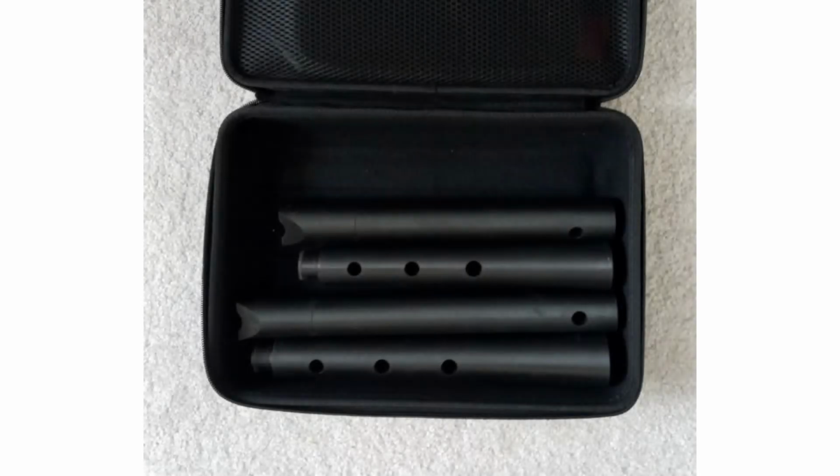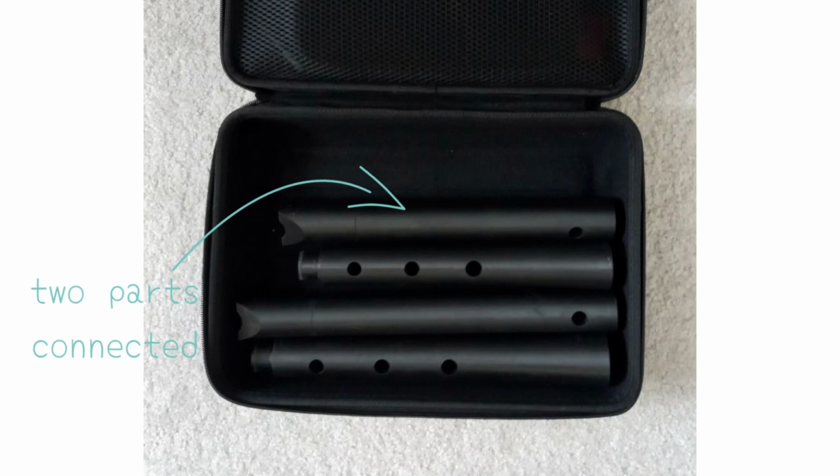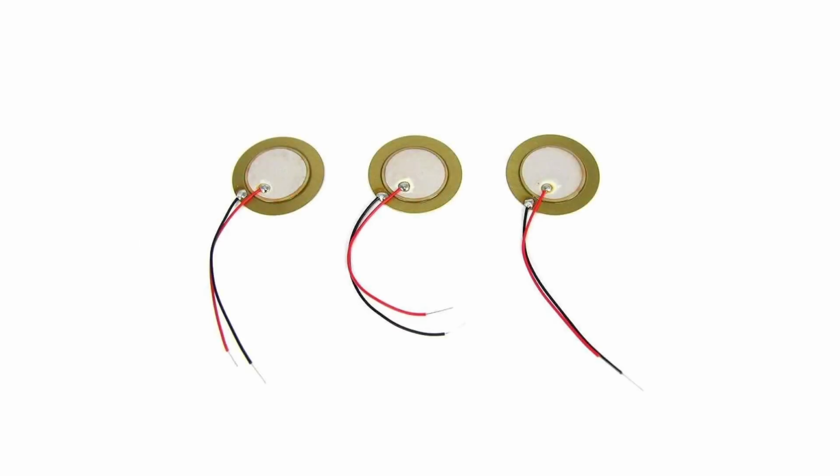As a lucky coincidence, the shakuhachi flute I designed earlier was made in 3 parts and not, as it is made traditionally, in 2. So I could make a modified version of the upper part, let's call it the mouthpiece, and use the other parts from the original one. The piezo sensor I've chosen is a disc 12 mm in diameter and about 0.5 mm thick. It should be positioned so that excess air pressure in the shakuhachi bore could push it and flex it.